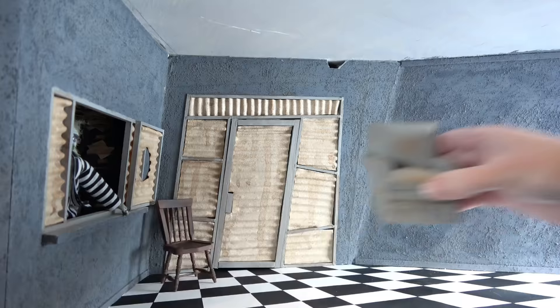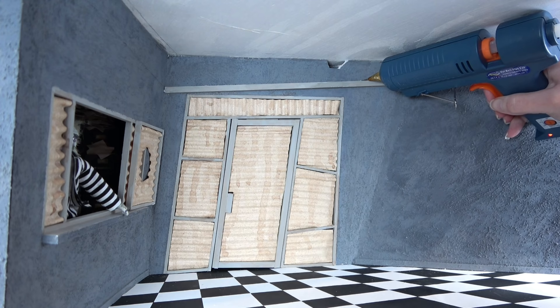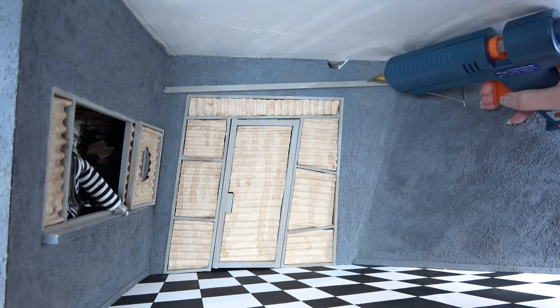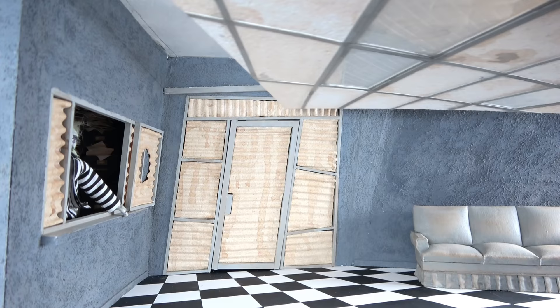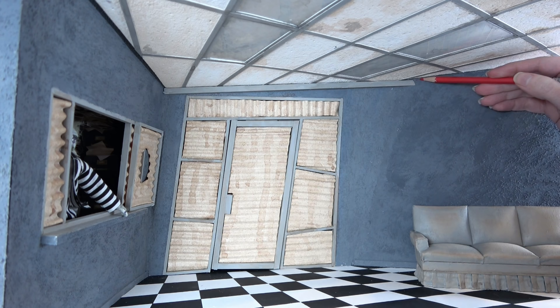It's going to be a piece of wood that's going all the way against the back wall. This is going to be easiest by removing all of the furniture and getting it out of the way because I'm going to be dropping things and making all sorts of mess inside the room. I consider this to be the most important part of the installation. This is the piece that my ceiling is going to rest on while I am installing every other part of it. I'm also making sure to check as I go along - if this piece fits well then hopefully everything else will go in seamlessly.